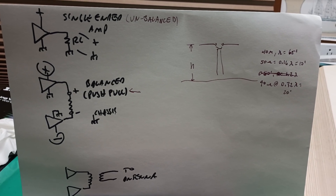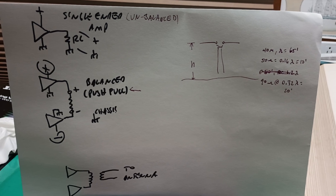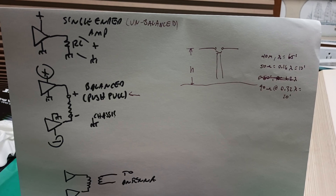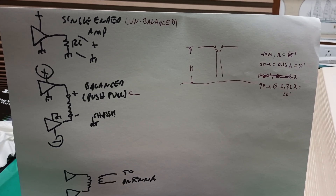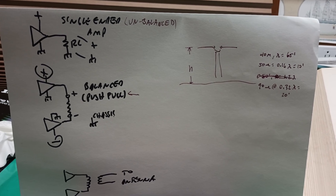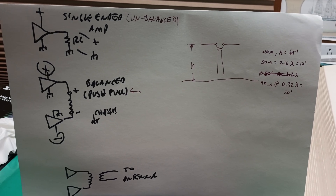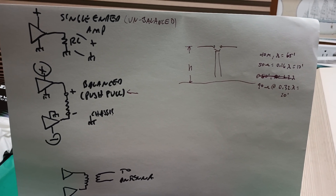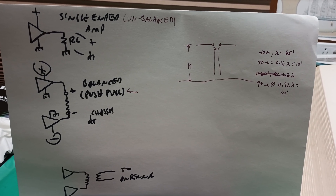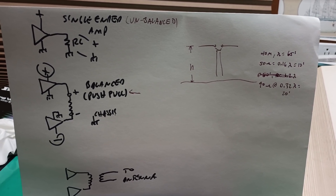That is false. As I've explained in my other videos on this Balun topic, Baluns are for transmission line to transmission line couplings. The characteristic resistance of coax is less than 90 ohms, while parallel lead minimum is about 120. So typically 50 or 75 ohms is coax, and 300, 450, and 600 is twin lead. It is not possible to connect them together directly — that's what the Balun or Unun are for. They are not for antennas.